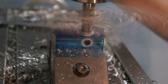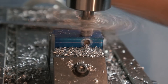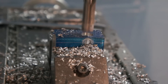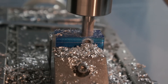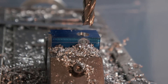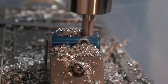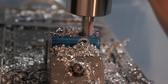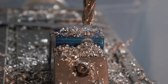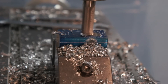Touching off to the material, then I'll bore a few holes and clean it up after. I'm using the hand wheels to move the head over where I need it and drill the remaining holes to clear out most of the stock. I do have a DRO on the Z axis and that's what I'm watching when I'm drilling down to the appropriate depth. Then I rotate back, compensate for backlash in the hand wheels, and drill the last side.